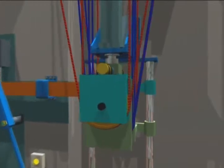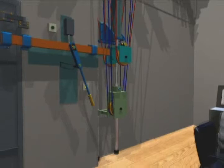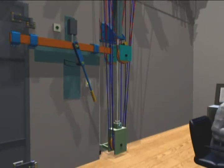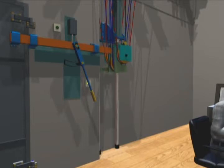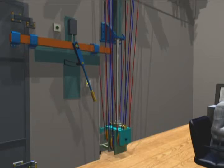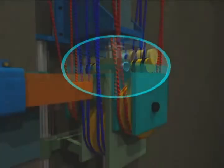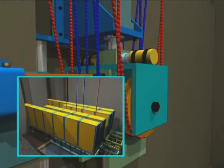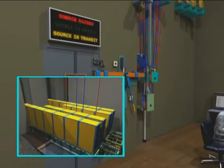The source movement is controlled by a hydraulic cylinder working through two sets of stainless steel wire rope systems. Two source lifting blocks are provided, one for the smaller source frame and the other for the larger source frame. A pneumatically actuated pin couples or decouples the two blocks. For lifting the entire source frame, the two blocks are coupled. For raising the smaller source frame, the blocks are decoupled.